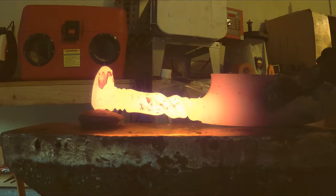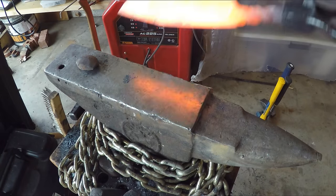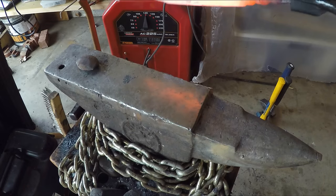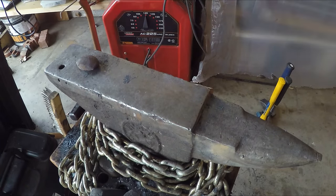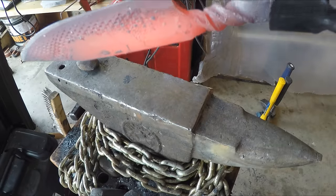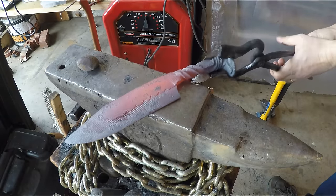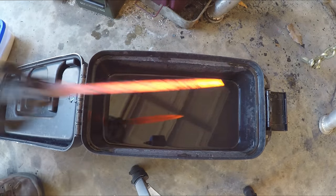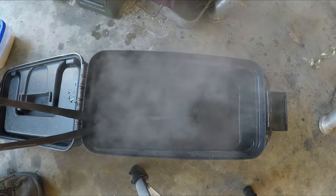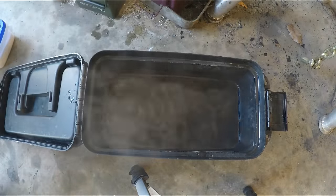The spine of the knife has a nice gentle curve to it and I'm going to maintain that curve here in the handle. I've normalized it — I put it in the forge to orange hot and now I'm air cooling it. This is going to relieve a lot of stress. I'm going to do this three times, because we put a lot of stress in the blade while hammering, and any unevenness in the grinding or otherwise are all points for fracture and warping. This is a longer, thinner blade so it's going to be prone to warping. This is file steel, so it's going to be quenched in salt water, and water quenches are fast and furious and can really be prone to cracking and warping, so those normalization cycles are important.